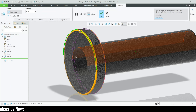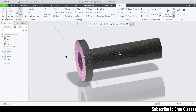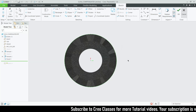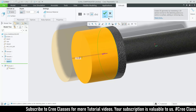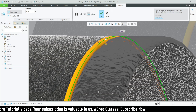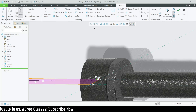After that, I added a couple of round features — four on one side and four on the opposite side. The next sketch is on the same outer surface again. I sketched using the same reference circle from the previous circle and extruded that to a length of 110. Then I added round features at the joint of these two circles with a round value of 3.